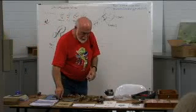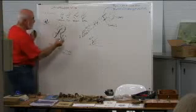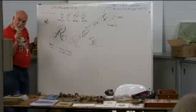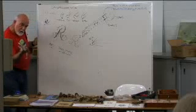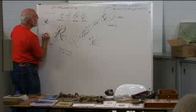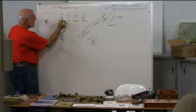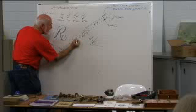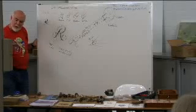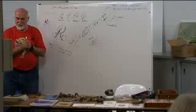Now the beauty of using the onglette is that I can use the fine point to establish my baseline, in other words that, but then I can use the onglette and tilt it backwards and forwards from side to side to build up my grace lines. So I can then tilt that shape over, so I'm cutting more with that leading edge there and just a little bit of the point there. So I can tilt that over, come back, revisit that line, and by tilting the tool slightly sideways, broaden that line into a nice grace line, a bit like watching the ice skating in the recent Olympics from Vancouver.